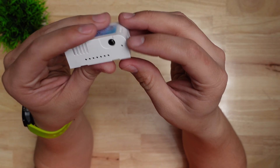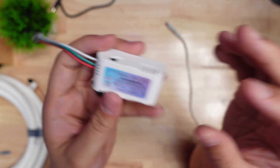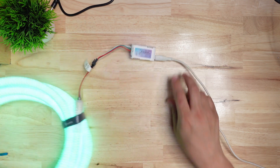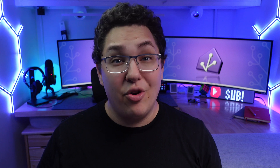They also say it has a sensor button but I'm not really sure what that is. It also has a barrel jack on the other side for DC power, taking 5 to 24 volts DC with a max current of 10 amps. I don't think this device has any fuse or relay inside, meaning power is just passed right to the LED strips with nothing to check the current if it gets too high. This may be a safety concern, so I'd suggest having some sort of external fuse in your LED setup.